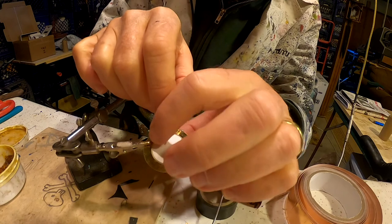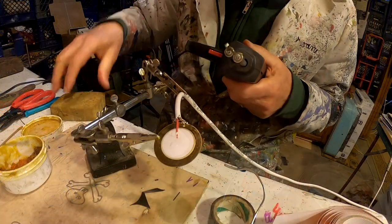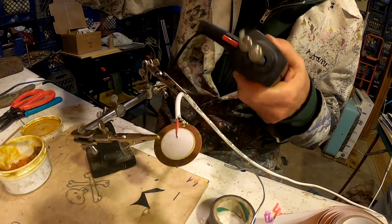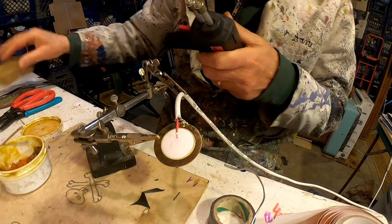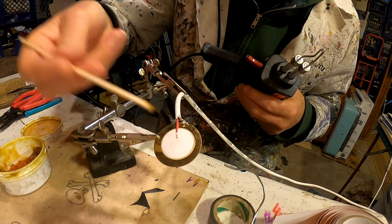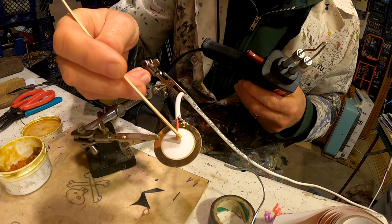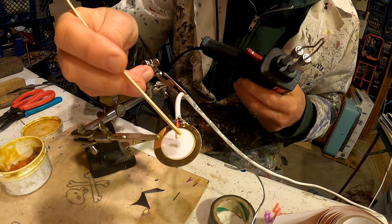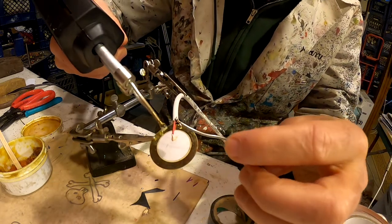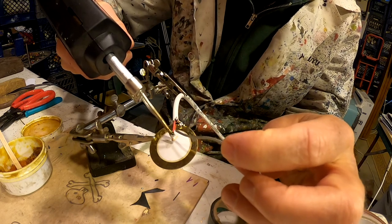And now it's time to position the other one. All right. Ready to solder it in the center, and we'll have the full contact microphone effect, cleaning off the tip of the soldering iron, applying a small amount of flux, to make the solder go where I want it to go, feeling that warm throbbing of the soldering iron in my hand.